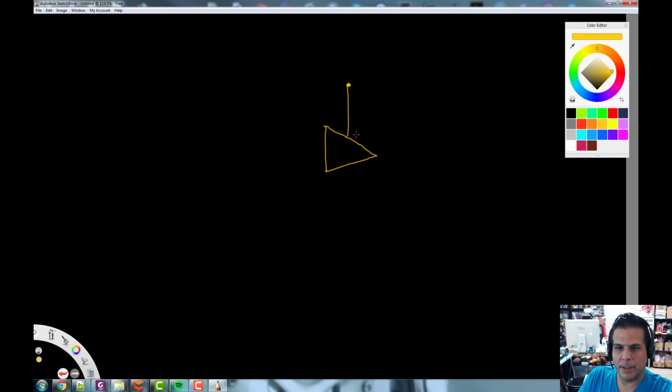So this is going to be V plus here, and then this is going to be V minus here. This is going to go to plus 5 volts. Here is going to be our output. I'm going to take our output right here. I'm going to call this V out. Then we have our 2 inputs here. Here's one and here's the other. Let's call them the non-inverting and the inverting.